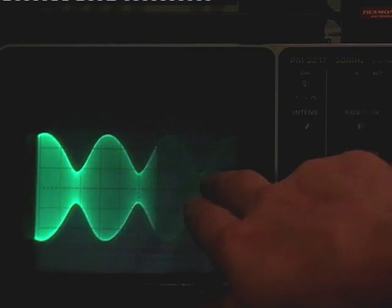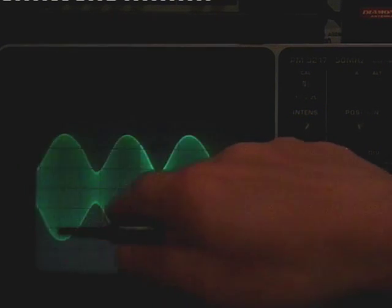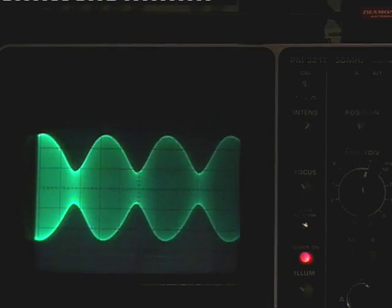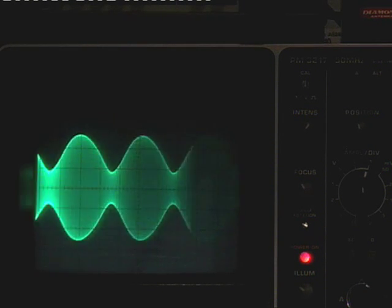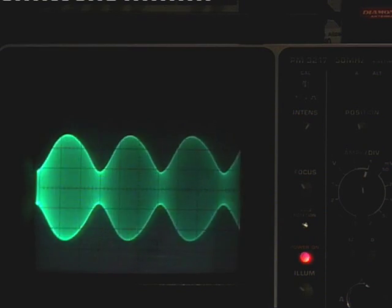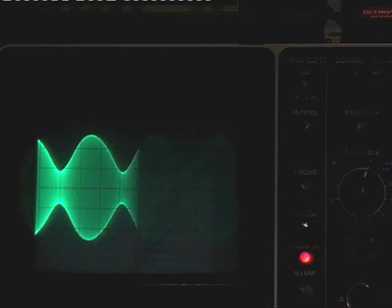So we have a little bit more modulation could be applied. You can see a nice rounded peak to the actual waveform. So there we go, that's upper sideband, 28.015 MHz on Eric's Hammer International Concorde 2 with quite a nice waveform, and the power has only dropped by just a couple of watts. Excuse the noise, that's the fan on the power supply just kicking in.